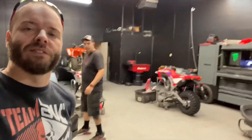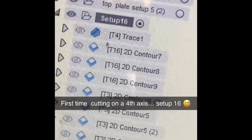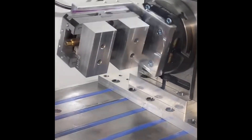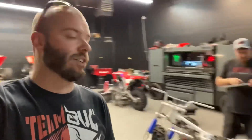Alex, what are you doing right now? I'm trying to find my lube. So guys, we did not forget about you — we've been extremely busy getting new equipment set up in our shop. We got the VF4 going, basically just had to take a week to draw fixtures, and we got the fourth axis going with new programs for the triple clamps. We've actually cut our production time almost in half — we have almost no handling time on the parts.